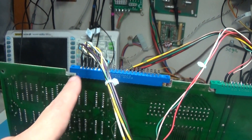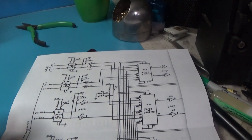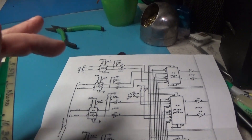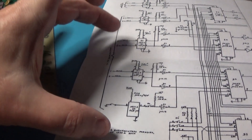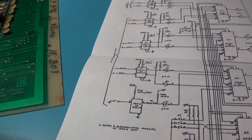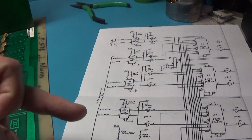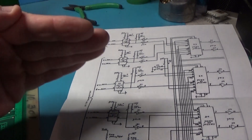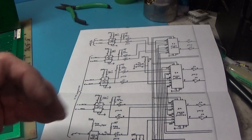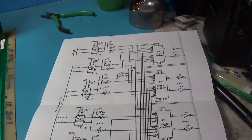I got those wired in, and then I had to create this connector with six lines. The six lines are the five bits — that's how the periscope works. It's a circuit board that has a wiper with six positions on it. It's a great big wiper that has six positions; one of those positions is ground. So it's just going across ground, grounding out and creating a five-bit binary code for the CPU to decipher where the position of the periscope is. It's really quite simple.